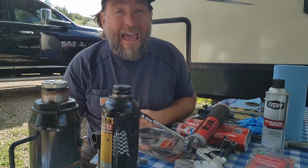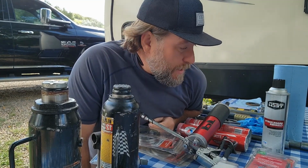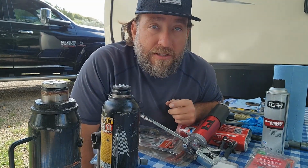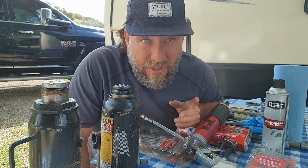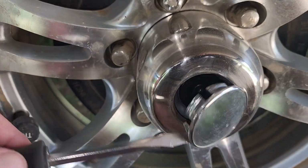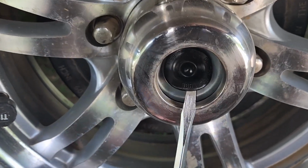All right, so now we are gonna go ahead and dive into the tools. Actually, let's dive into the types of grease and the types of cleaner that you use in order to be able to do your general maintenance. So when I'm talking about general maintenance, the first part is every 5,000 to 6,000 miles, you're gonna wanna put a little bit of grease in each one of your axles, if you have the easy grease axles, and I'm going to show you how to do that here in a few minutes. All right, so that's really important.